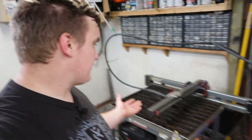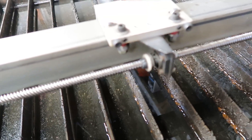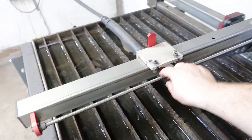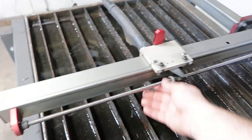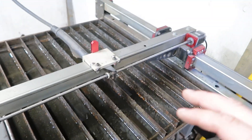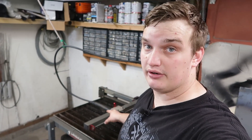I think that's a pretty good testament to this thing. Some issues I've heard about are people saying they needed to lubricate the lead screw bearings. I don't know that I would recommend doing that — I just take a rag and dust them off. These are made out of Delrin, which is a self-lubricating plastic and does not necessarily need or should have a petroleum product on it. Just keep the dust off and keep them clean.